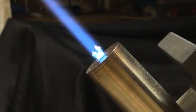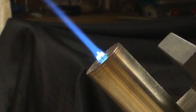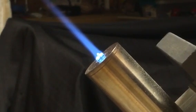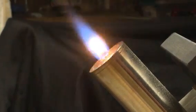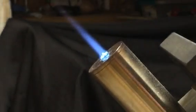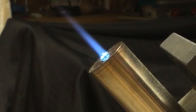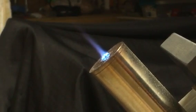You can get that really small flame, and if you're worried about your torch heating up too much, you can open your outer oxygen. Right now all I've got is a really tiny flame and my second stage oxygen is open. Regardless of how small this flame gets, it's still going to be cooling the torch because you've got your outer oxygen on. This way you can have your outer oxygen on and just turn on your propane when you need that extra second stage — just crack on the propane and turn it up to where you have your oxygen set. This will keep your torch cool no matter how small that flame is.